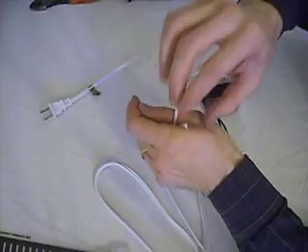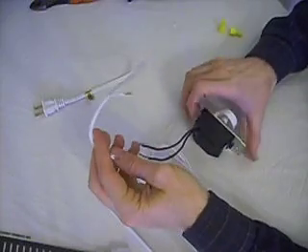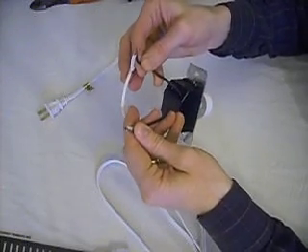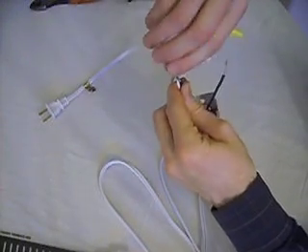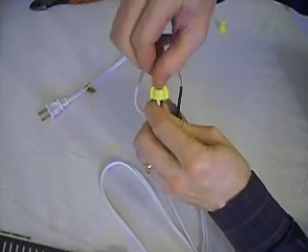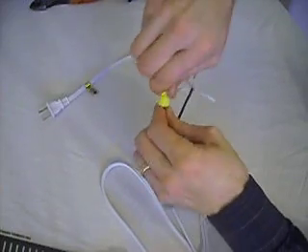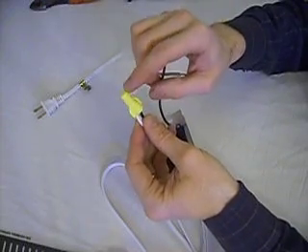I like to twist them just to keep the copper wires nice and tidy. Then you'll take your dimmer switch — you've got two wires here. All you're doing is splicing it in: one end goes here, one end goes there. That's all there is to it. Take those ends, twist them together a little bit like that, then take what's called a wire nut — light switch dimmers come with these. Turn it into place until it's good and tight, give it a little tug to make sure it's in there securely. That becomes an insulator to make sure no wires are exposed.